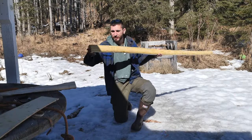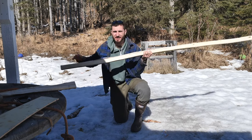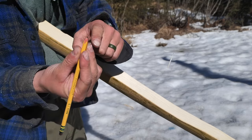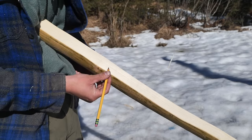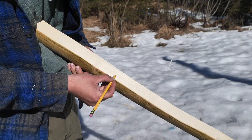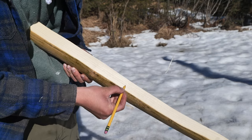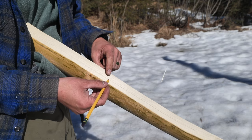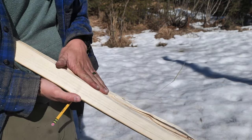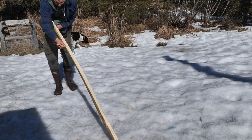This is now just over two inches wide from end to end and I just need to get the thickness the same — I'm just guesstimating about a half an inch. I put my fingernail against the bark here and then drag my pencil about half an inch and do the whole side of the bow. Everything from this line towards the cut side of the wood needs to be removed. I'll make sure that I leave extra for the handle though.